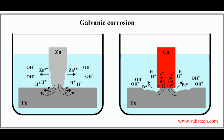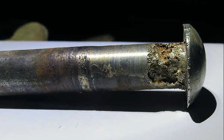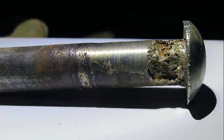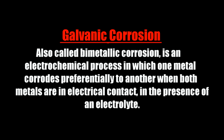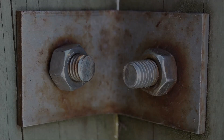First off, what is galvanic corrosion and what are we looking for? Not every single person in the audience is a chemist, so we'll throw some photos up on screen so you can identify what it is we're actually looking for. Galvanic corrosion is the process by which two dissimilar metals interact in an electrolyte to preferentially corrode or oxidize one of the set of metals. There is still going to be a baseline of oxidation of both metals regardless of their interaction with the environment.